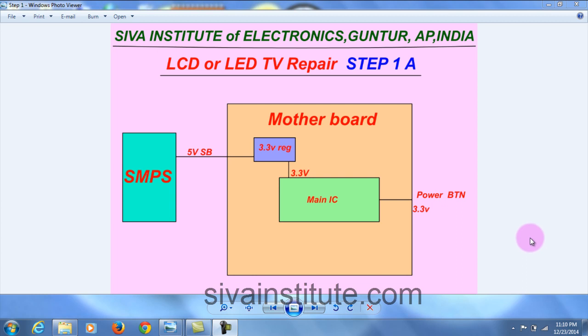I will explain how to check a dead LED TV or LCD TV step by step. This is the first step. See here, SMPS. From the SMPS, a 5 volt standby voltage comes out. You will see 5 volts is present, which means the SMPS is okay.